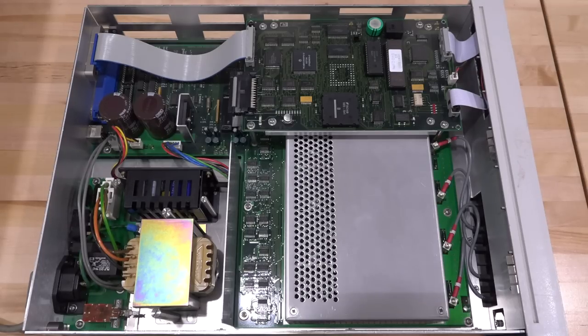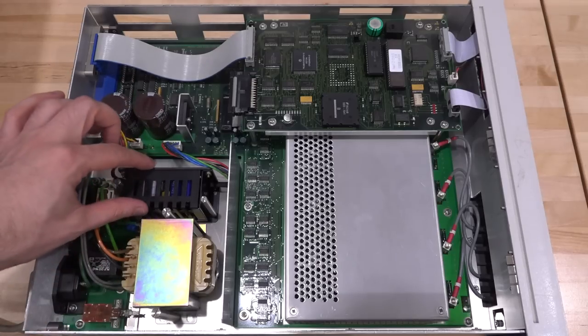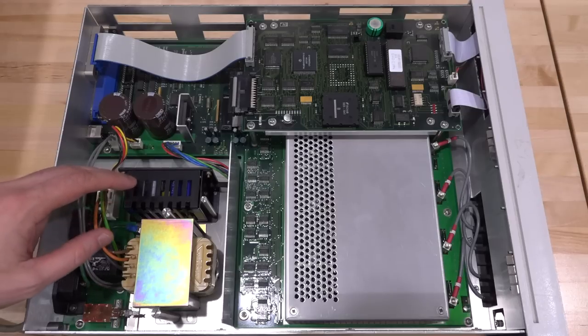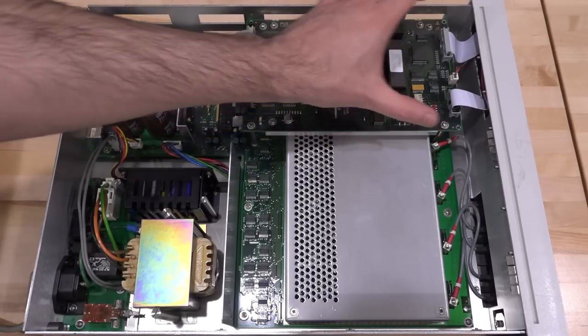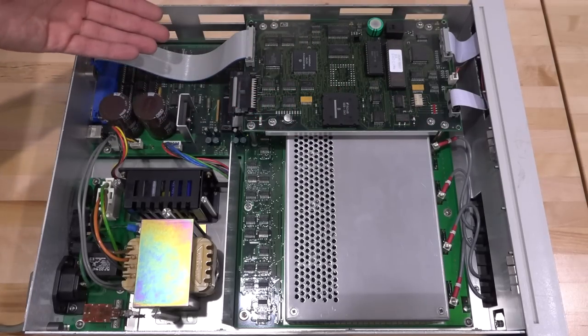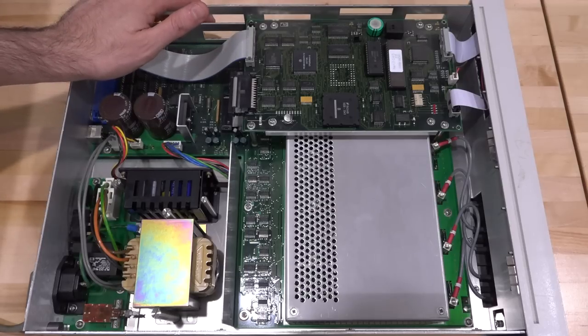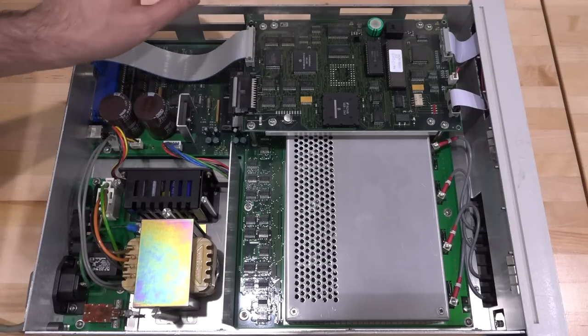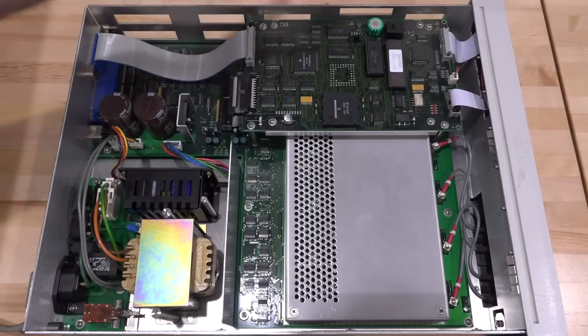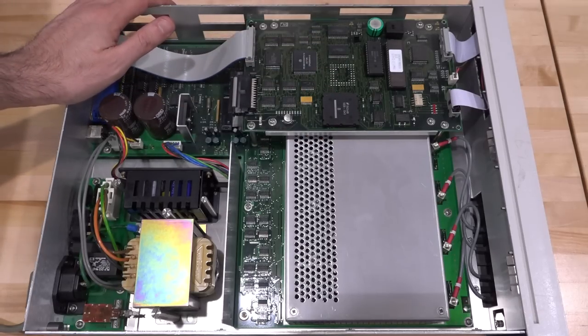All of these instruments can likely make a vector measurement, which is needed for impedance as LCR meters require. They change the analog front end and use the same DSP, digital section, and power supply. We have a little dedicated power supply, which is exactly the same as in the LCR meter and milliohm meter I've repaired. There's a single digital board with GPIB connection, a ROM dated 1996, a supercapacitor, and a little beeper — which does beep, meaning something is happening.